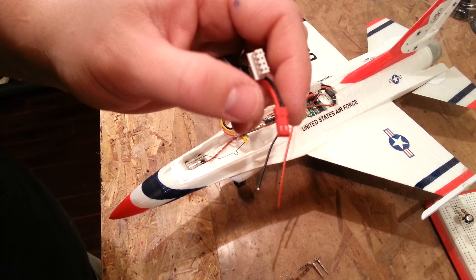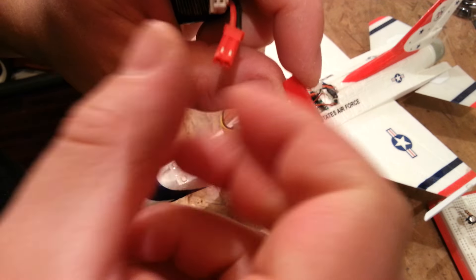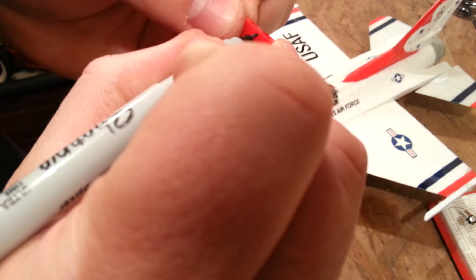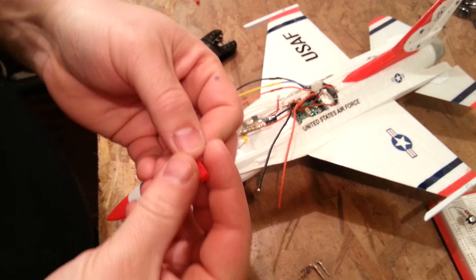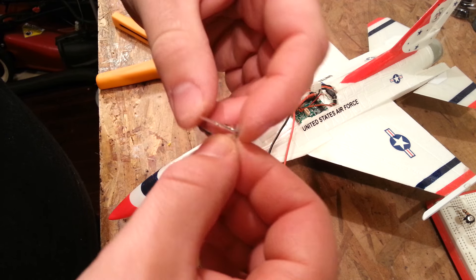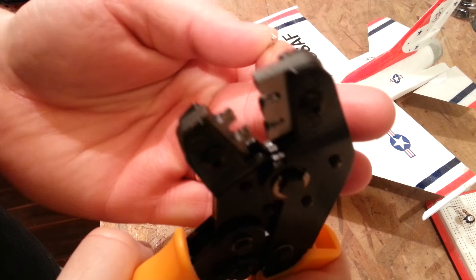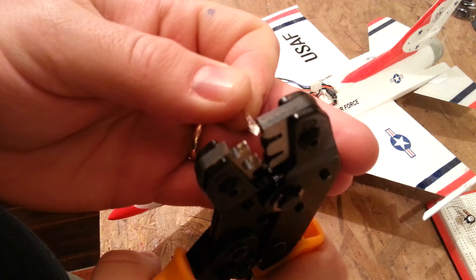Now I'm going to double-check everything fits together properly before I start building — no sense building a connector that's not going to work. Number one is black, number two is red on this one, and that's the money item — that's the battery. The battery dictates what the polarity is going to be, not the airplane. So one is still going to be black for us. I'll make a quick cheat sheet: number one is negative, number two is positive.